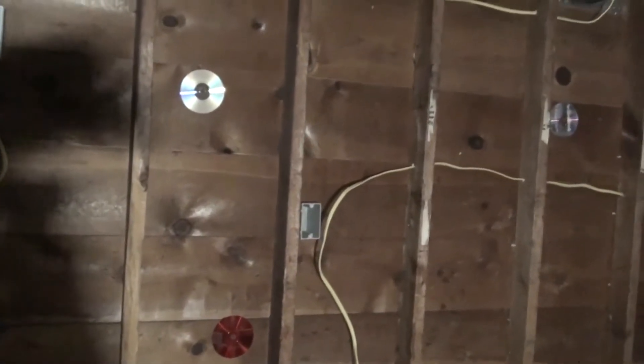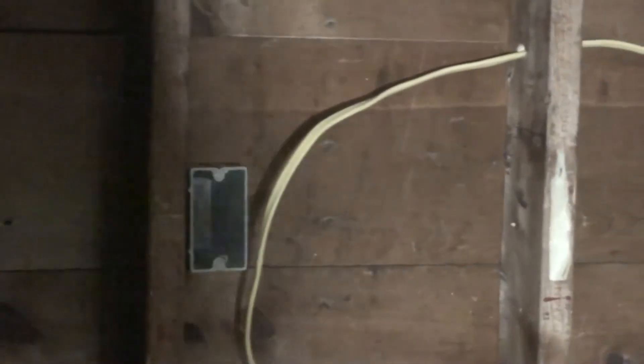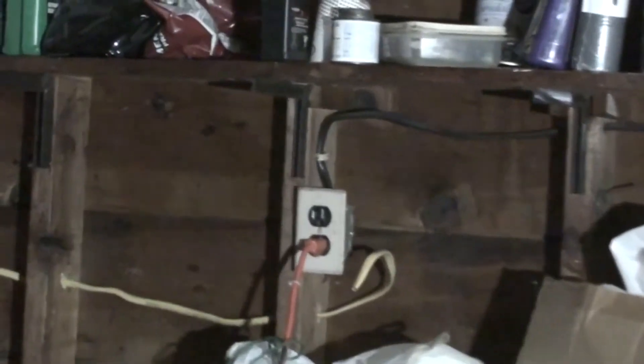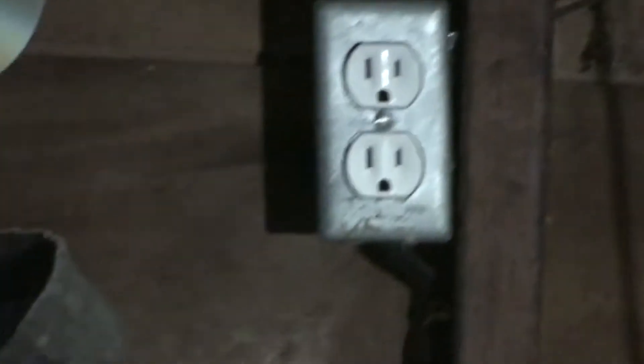Just to show you what I did: I have the switch box there, I have the wire going all the way to that particular outlet where I will actually make the connection through the studs — you can kind of see that — and I'll make the connection here too. I'm going to have to remove this outlet here because we can have only 10 outlets per 20-amp circuit.